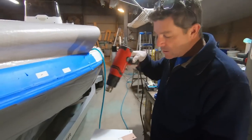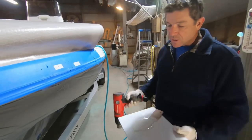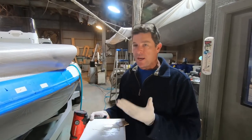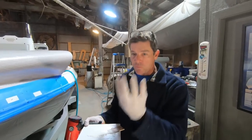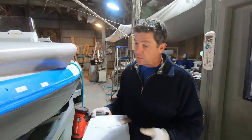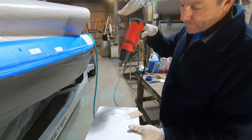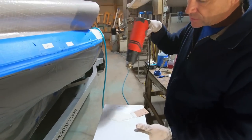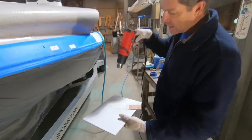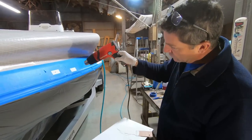Sometimes when applying in thin batches, we'll give this material a little bit of what's called an induction time — that's pretty common with a lot of paints where you have a catalyst. You mix it up and let it stand for a few moments. Gel coat doesn't have a very long life so you can't do a lot of that, but in cooler weather in smaller batches you can get away with it. This heat gun puts out a lot of heat so I'm going to alternate between the two areas.